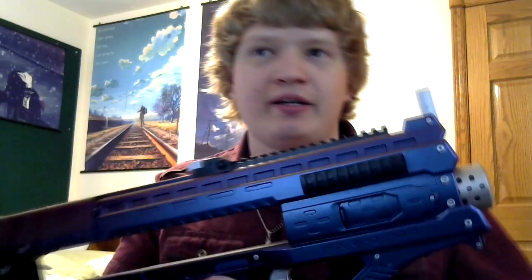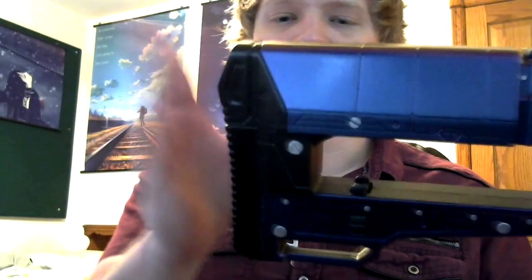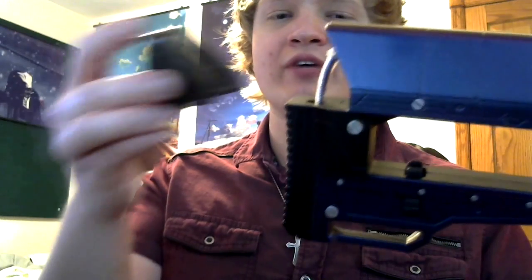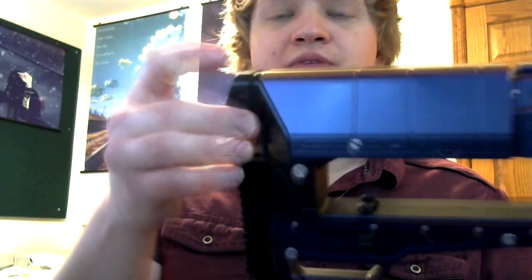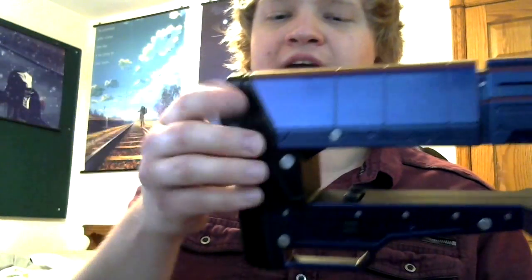As for internal mods, nothing special. 16 gauge rewire, 3S LiPo, high amp micro switch. Nothing special there. The battery compartment holder is now held in with neodymium magnets instead of those stupid screws, so it is way easier to replace, and it holds it very well.